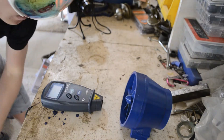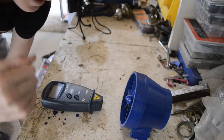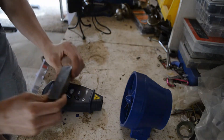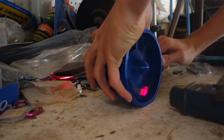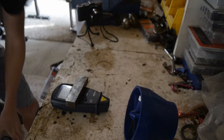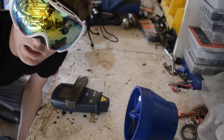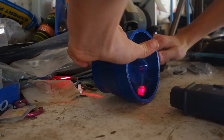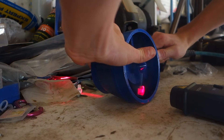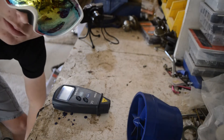Let's do 100 psi. Alrighty, so I have the compressor at 75 psi — not 100 — because I kind of want to see if there's any difference between them. I have the tachometer right here. Got a piece of steel bar to hold that down. Surprisingly, I got 21,000 RPM. Holy crap, this thing does not make a lot of noise. I'm going to test that again. Okay, 21,000 RPM was not accurate — now I got 3,700. I was honest on that one.